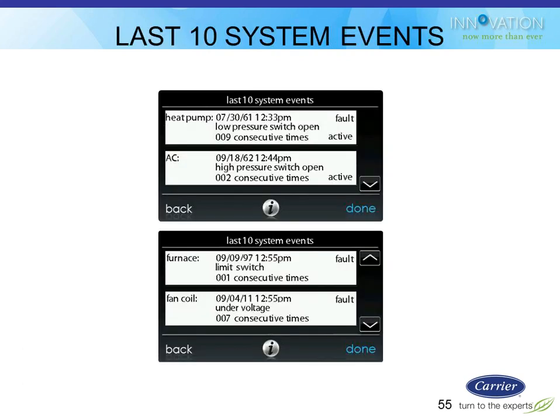I don't know how accurate it is, but it can't be any less accurate than any other weather forecast you've ever seen. The stat itself will also show you the last 10 system faults, very similar to what you've had on other Infinity products in the past, and it does it in a fairly plain English fashion. So it tells you the timestamp. Apparently this one happened in 1961. What the heck is that? But it tells you the timestamp, and then tells you, in this case, low pressure switch open, so you can see that and you know what it is. And those same events will also populate onto the website,